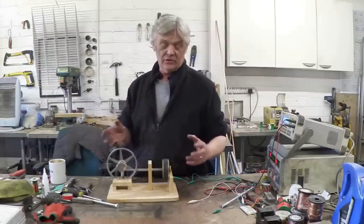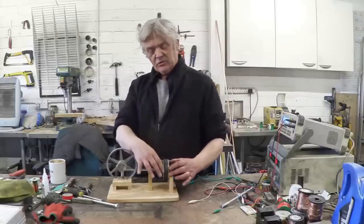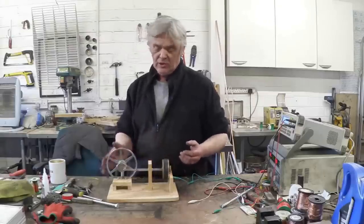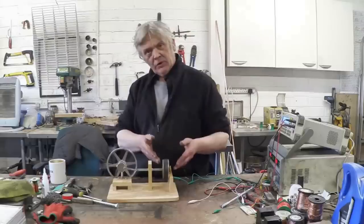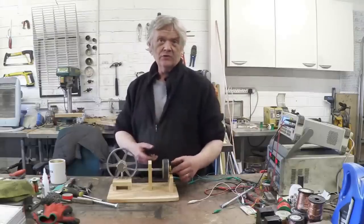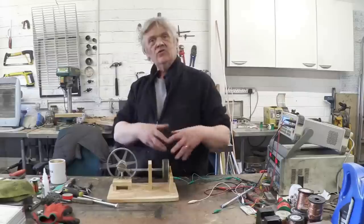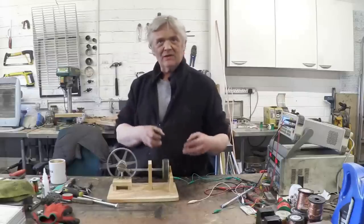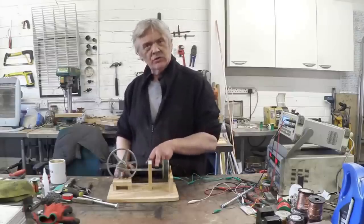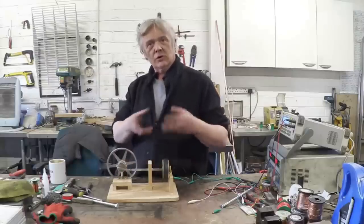It works because it's switching reluctance. We have this big ring magnet here — it's north-facing that way and south-facing that way. All the magnetism goes into these two steel plates, but there is no path between the north and the south until we put that rod in. When we put that rod in, the flux can pass up the rod and go from north to south, and of course the coil is right in there, so when it does that the coil gets a magnetic field. Now, when we draw that rod out, we take away that path, so that magnetic field collapses. So even though the coil and the magnet are stationary, switching the flux using the rod in and out allows that magnetic field to grow and fall, grow and fall.